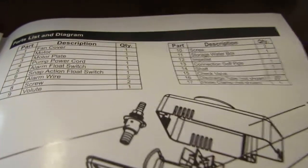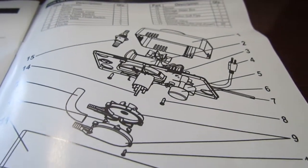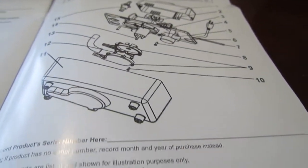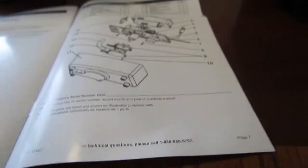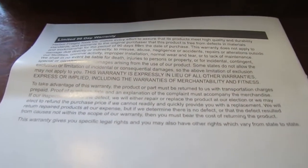That's something else too — if you have a crawl space, especially here in South Alabama, the only crawl spaces that really work are ones that are encapsulated and encapsulated properly, where you have a dehumidifier down there actually discharging the water outside of the house.